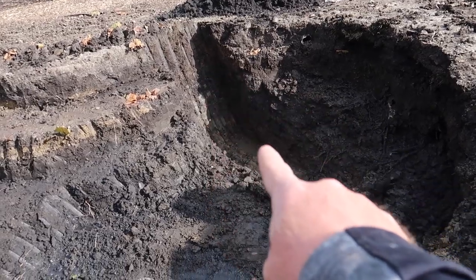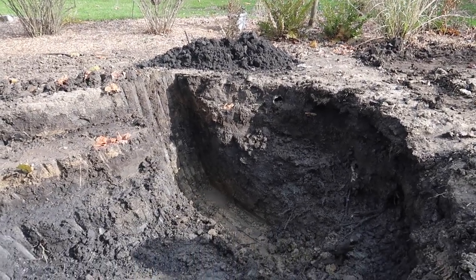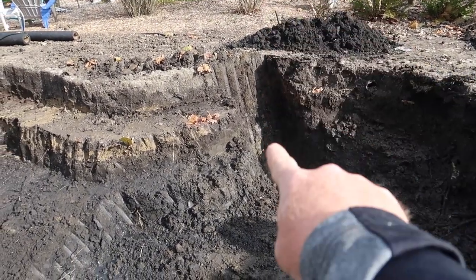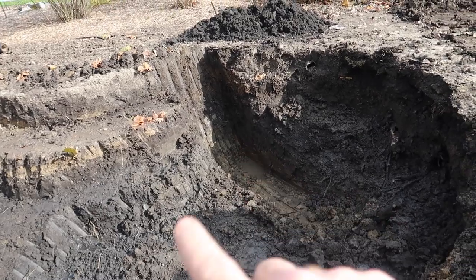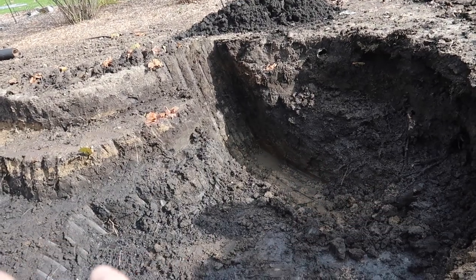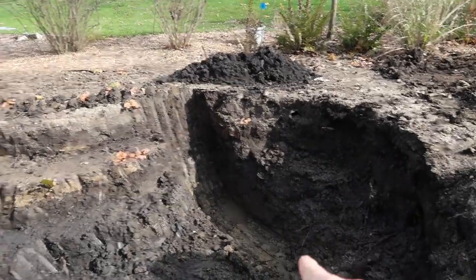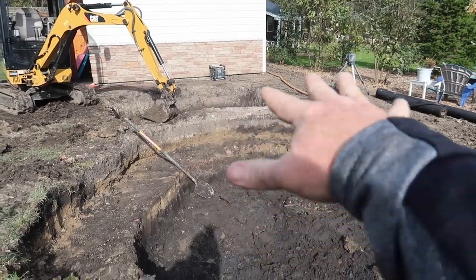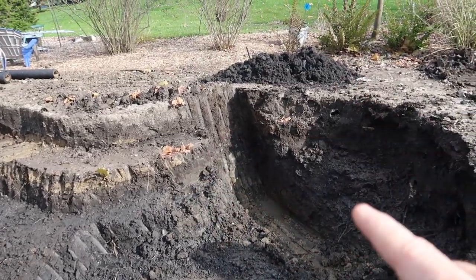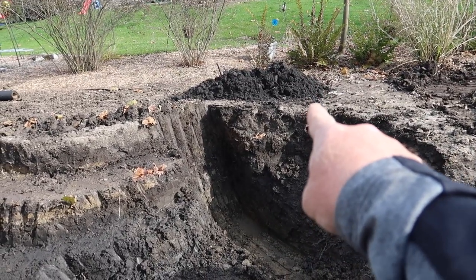If you can make out this trough area right in here — this is something we're going to try. Our liner is going to conform to this area. The skimmer box is going to go right there, and then we're going to have a snorkel and a centipede coming in through here. What this is going to do, as all that stuff sits on top of the liner, is actually circulate water from the bottom of the pond, pulling all of that stuff off the bottom. That's going to then feed the wetland filter there, circulating warmer water and pushing it up. The reason we chose the location of the snorkel and centipede right here is because our skimmer box is going to go right there — I want all of my water pulled from basically the same area.